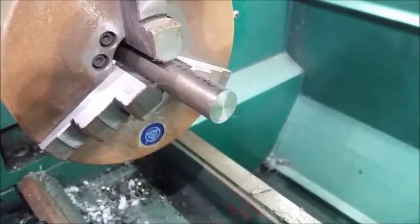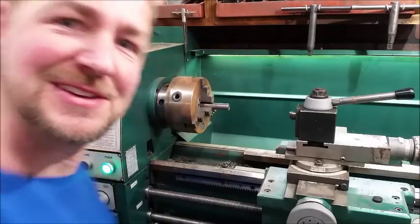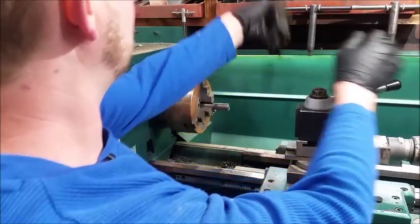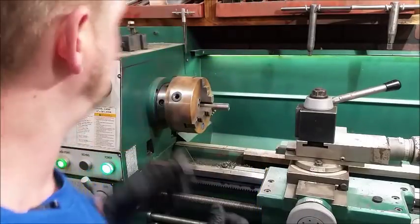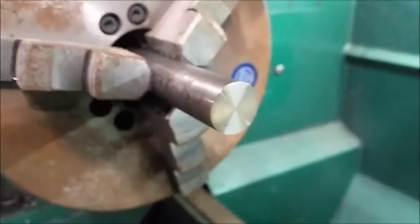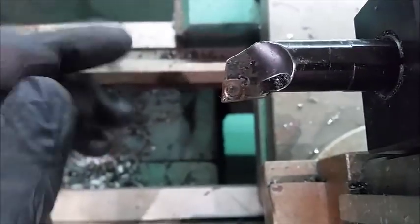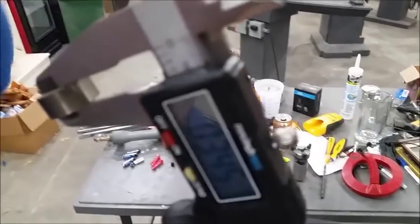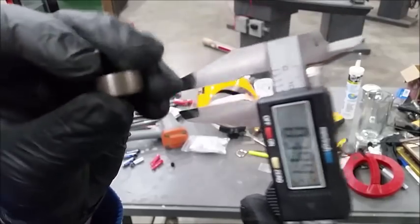I like this material. This video is more to show a first time cutting nickel. Apparently I'm the first to show a video cutting actual plain nickel rod — there are companies showing off their own metal, but not someone just cutting plain nickel rods. I use a boring bar, and one technique I use is cutting out rather than cutting in — cutting on the edge and not on the tip, especially on back cuts.